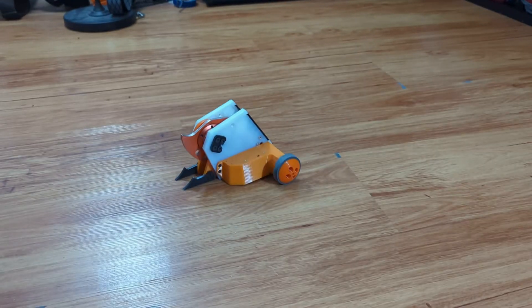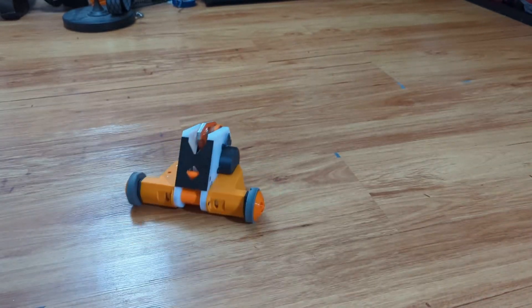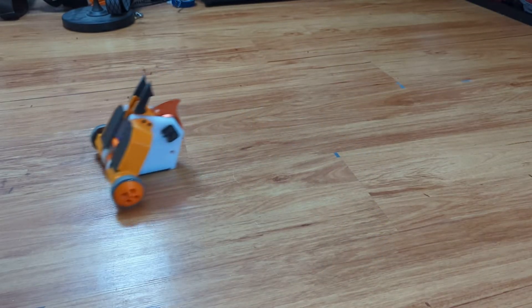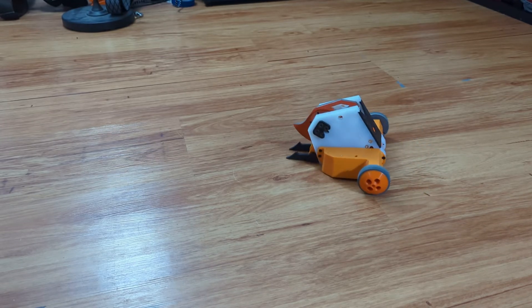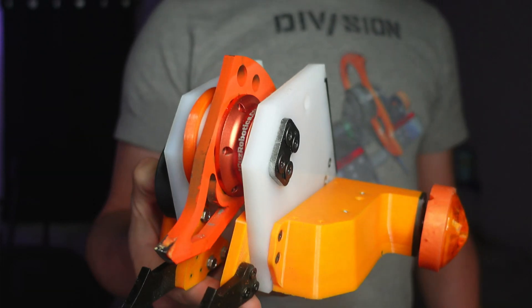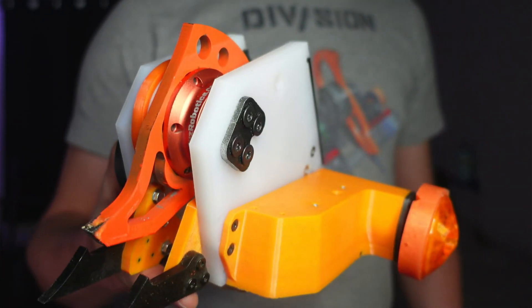Overall, this design is very monsoon-inspired. It can run upside down, right side up, and it can self-right even on its weird diagonals from the side using just the drive system. I don't have to rely on the weapon to have a huge amount of torque anymore, which is what allows me to switch to this hub motor weapon instead of needing a belt drive system like I had on version 3.